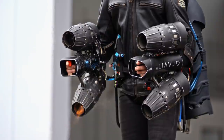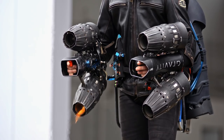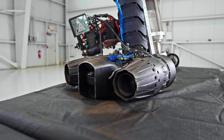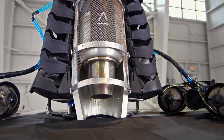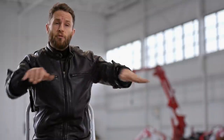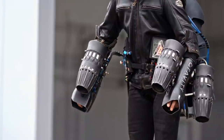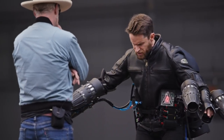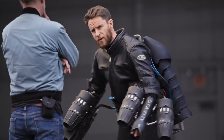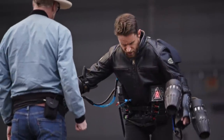We've got a jet suit here, which is made up of five jet engines, real micro versions of the gas turbines you have on a jet fighter or an airplane you go on holiday in. Now, the arrangement we've ended up with is two on each arm and one round the back. And if you imagine that really between those five engines, they create like three legs of a camera tripod. Rather than controlling the throttle of all of those engines, it's worked really well to do something called vectoring. The idea is as you squeeze on the power, you're leaning forward slightly, so that rear engine is actually leaning back a bit. So that's one leg of your three-legged camera tripod. Okay. And then you've got the other leg here and the other leg here.